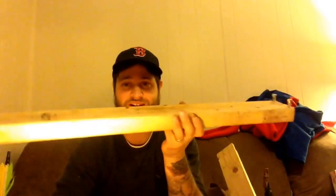Well, uneven taper causes all kinds of problems. It causes poor tillering first and foremost, but then it leads you to being prone to hinging because you put more pressure in one area of the limb versus the other end, so you get a thinner profile right there. So what I did to correct that, and I probably saw it somewhere because I'm not real smart, was switch to a 2x4.